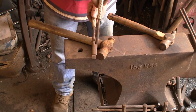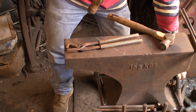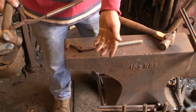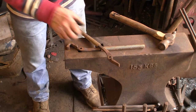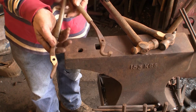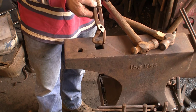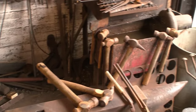You can see now that they're coming apart - well, not easily, but they are coming apart. A slightly smaller punch - just popped it through. There we go. So we've got them apart. This one I'm going to leave alone because it should grip the side of the shoe nicely. This is the one we're going to cut off and draw out because obviously it's going to grow, and that's why you need to cut a piece off - I want them to end up back at equal length.